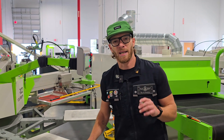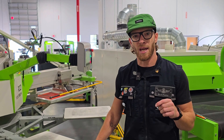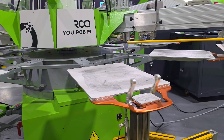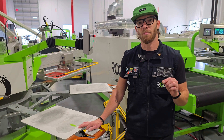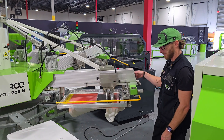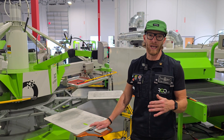If you're not using your press every single day, this battery will not last two years. Based on your printing and how often you turn the machine on will dictate when you need to replace this battery. I'm going to go over the couple different places where you'll find this battery located and what models you'll need to do this on, because not all models will require this.